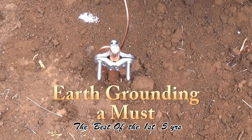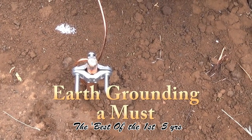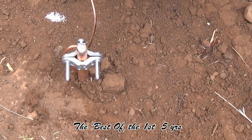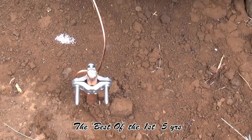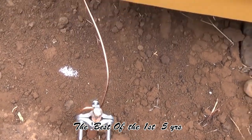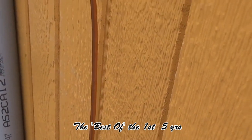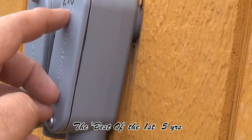Jeff on the Hot Homestead. Today's video, I'm going to talk just about grounding my solar system. My solar power here off-grid — I'm going to show you how I've got everything grounded. Right there is my earth ground. It's six feet in the ground, and I've got that copper wire going to that copper post — that's six gauge. I still need to anchor it to the barn, just so I don't have it flexing around, make it look a little prettier.